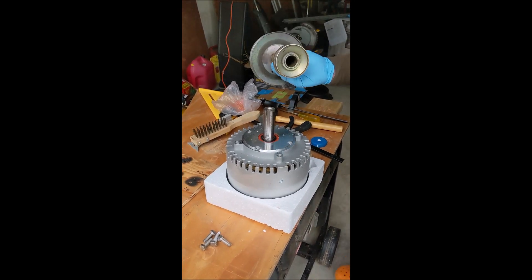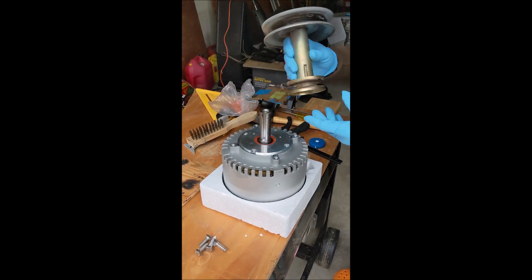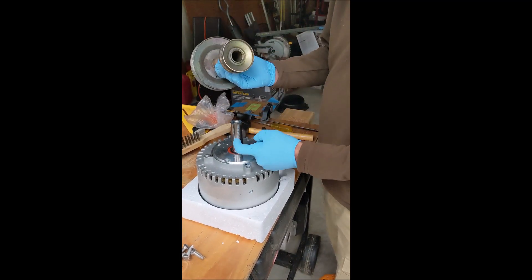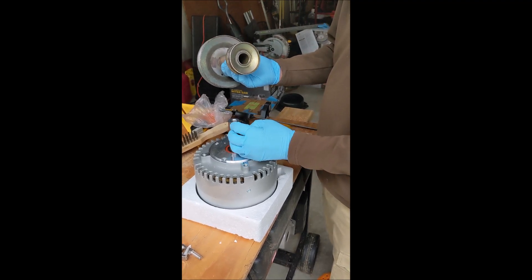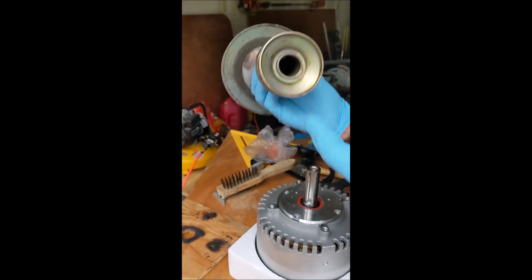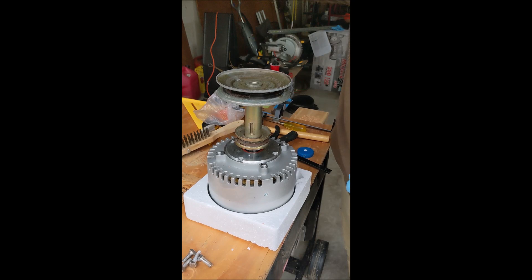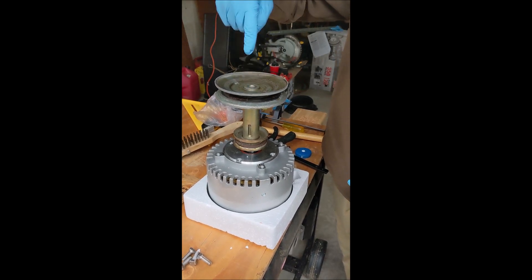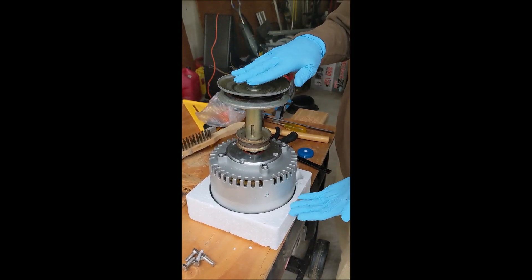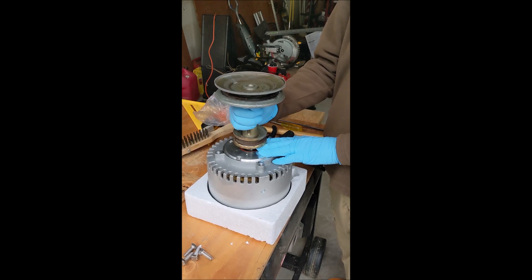In case you're thinking about doing this, I want to show you how the pulley goes on. This is a Scotts lawn mower made by John Deere — a pulley drive. Imagine everything here is upside down. The shaft here, the one-inch shaft, has a keyway. We've removed the key because the pulley in this case has a built-in key in it, and that goes on like that — drops in, sits clean. Then there's a large bolt that goes through the center and tightens onto that with a lock washer, so this can't drop off in operating condition.